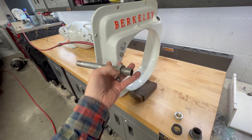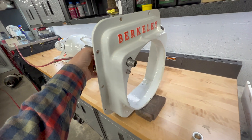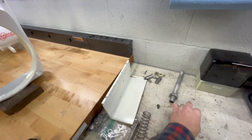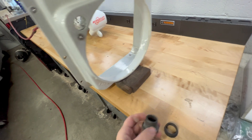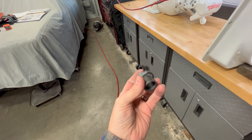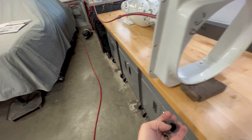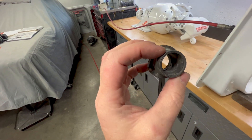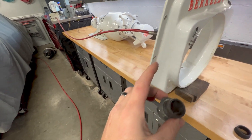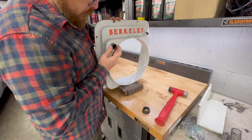You'd have your steering tube here with a jam nut, a piece of rubber o-ring, and another jam nut — that's where your normal steering cable would come through. These are some of the pieces I mentioned that you can't get anymore, but you have to have them to make this work. There's a plastic adapter that you install through the transom and a rubber grommet on the back side. This plastic adapter has a rubber o-ring on the inside and allows us to run the new steering tube through the transom.